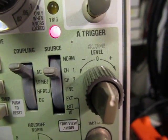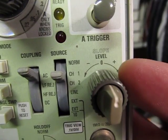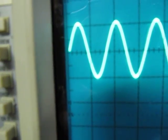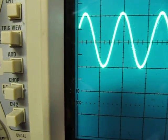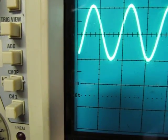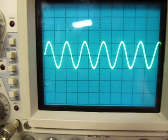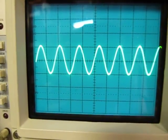The level control says where am I going to trigger on the waveform. It's a control I can move back and forth vertically. If I'm moving it positive and negative and we look at what happens on the scope: if I move the trigger level up, we can see we're starting the sweep at a later point in time, or a higher point in the voltage. If I move the trigger level down, we're triggering at a lower voltage level. So you can pick and choose where in the waveform you want to trigger. With a complex waveform you might pick a particular amplitude — for example, with a distorted waveform you might trigger on the peak so you don't get a double or triple waveform on screen.